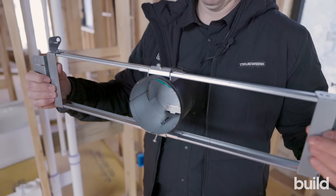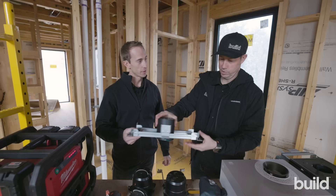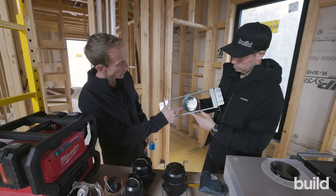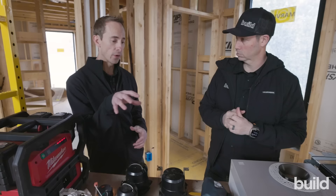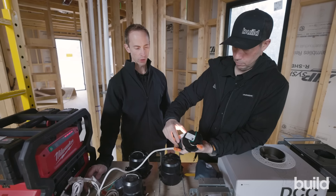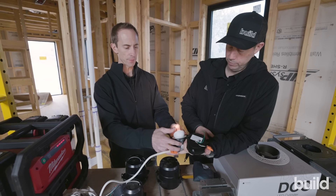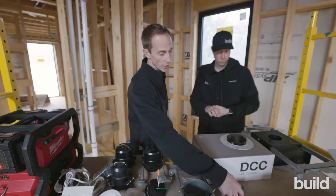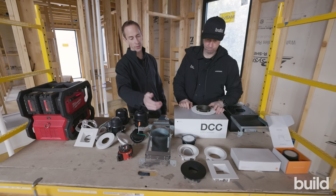Next is the M-Series — there's clearly been a lot of engineering done here. The screws are pre-drilled in the housing, so there's no grabbing from your pouch. There are two wing nuts pre-installed, and it gives over an inch of vertical play so you can move the housing later. The adjustable module is available in the M-Series. You've also got a fixed module option. Trims come in square and round, with pinhole options, wall wash options, multiple colors, clear diffuse, and warm diffuse.